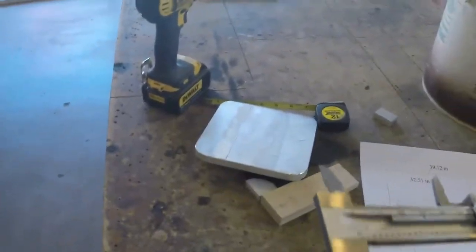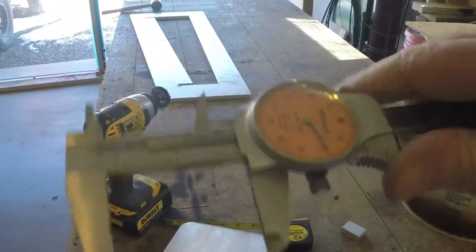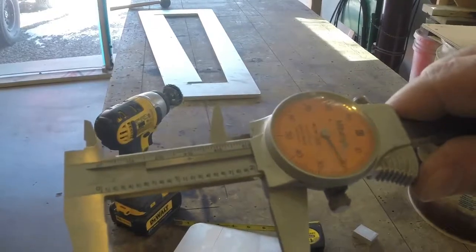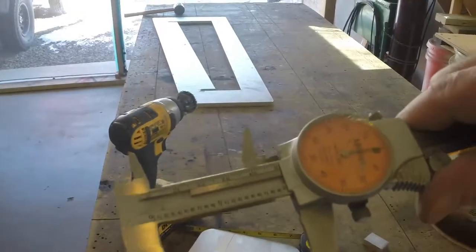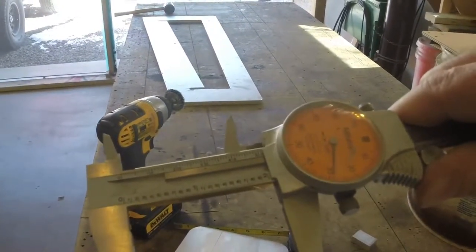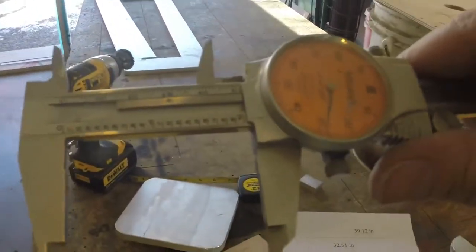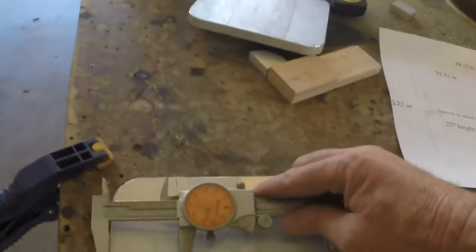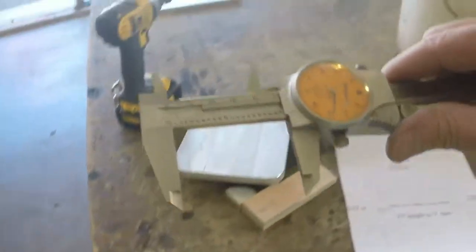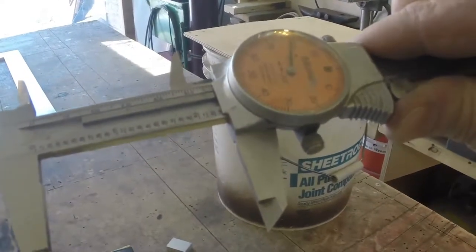And what I did was instead of paying attention, I rolled out to my 2. And I just do this. For me, this is morning, and I always do dumb crap in the morning. So I went 2, and then I went 2, and can you see that? And 8. That's what I did. Now, that's actually 0.28, what I've just done. But it's a big difference between that, which is beautiful and wrong, and 2.8, which is right there.